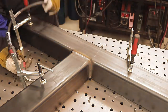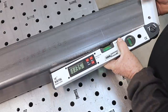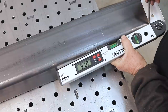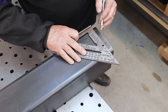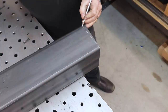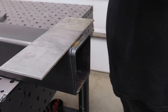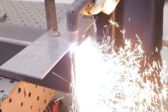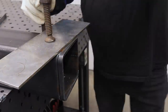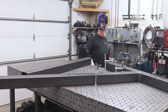There's the first pass around. I've just done three sides and I ultimately have to flip it to get the other side — I'll need help with that. I needed to hit 97 degrees with this angle, and there it is. I'm using my silver pencil — I get those on Amazon. A lot of guys ask why there's orange tape around the pencils: I have a bad habit of putting pencils in my mouth, and the painters tape keeps me from getting wood chips in my mouth. Just cutting this off and a quick hit with the flap disc, and I'm ready to put the third piece of the column structure together.